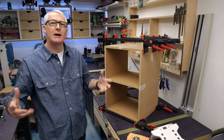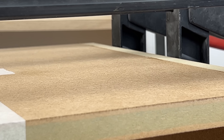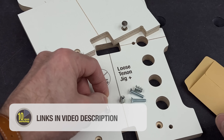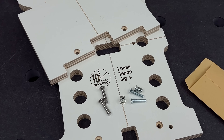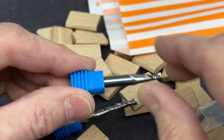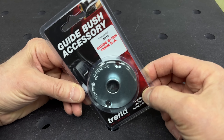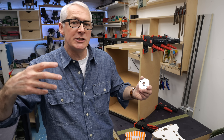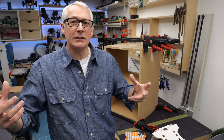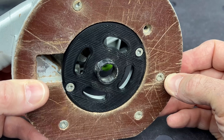That's not looking too bad — it's all clamped up, gone together very nicely with nice tight joints on the edges, which is what you want, and the shelf sits flat with no hint of wobble. The Loose Tenoning Jig Plus is available now in my Etsy store, priced at £85, complete with reference pins, threaded inserts, and machine screws. There's a Starter Pack Plus at £25 that includes both the 5mm solid carbide spiral upcut bit, dominoes, and a 4.76mm solid carbide bit for shelf pins, together with a small pack of 5x30mm dominoes to get you started. There's also an optional Trend 18mm guide bush — the Trend fitting is a version of the old Elu standard, which is pretty common, but if your router uses a different fitting, I may be able to put you in touch with a team of 3D printing experts who can make an 18mm guide bush for your router at a very reasonable price.